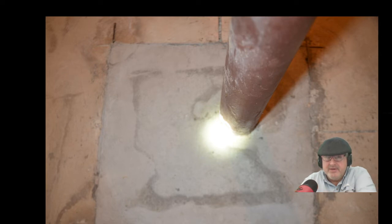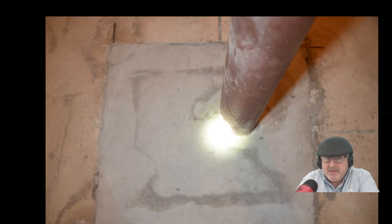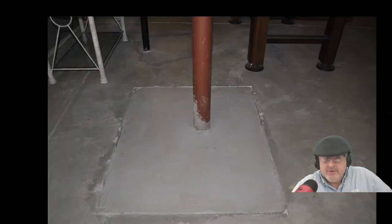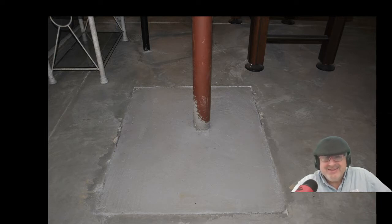This is a little bit better: take a saw, cut the floor, get down maybe a foot, and pour a footer. They put a footer down, then an inch or two of topping — what you're looking at on top isn't structural; it's the bottom sitting on the footer that matters, and this way it'll never move. Here's an excessive footer — this ain't going anywhere; you could probably land a helicopter on this column. A lot of people don't do it right — they'll just put the column next to the old column, which helps but isn't the right way.